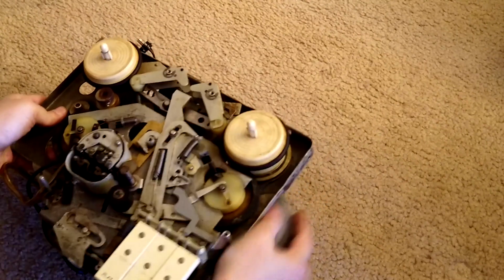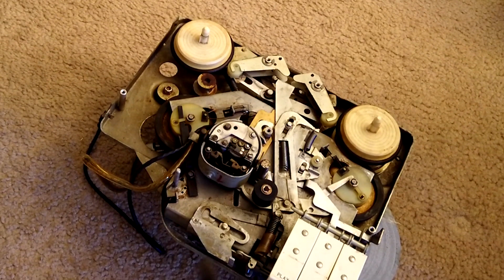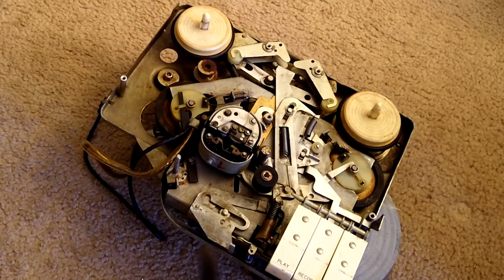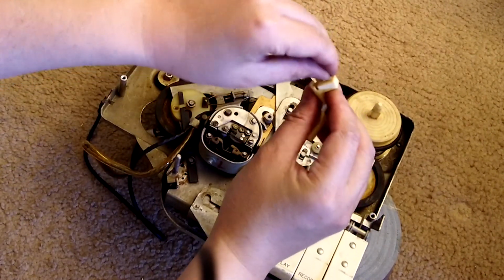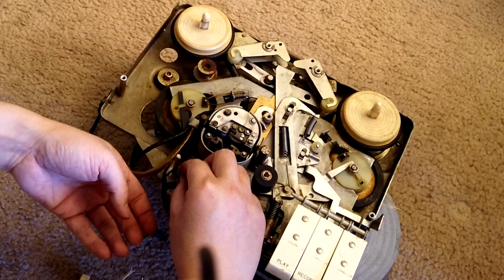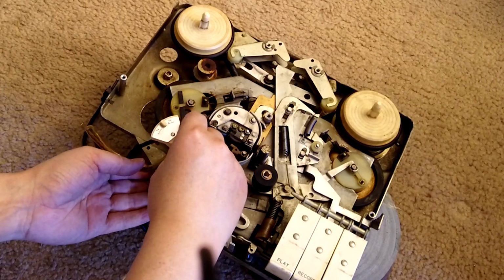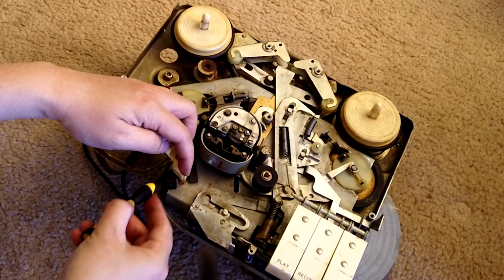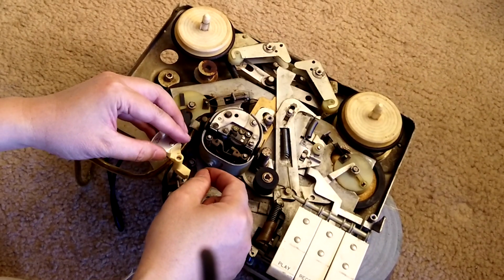Now remember the speed switch here, and that's the part we need to put back first. We need to put the upper back first, then we go to the bottom. So to do that, just remember you have the spring inserted here, right? And you put your balls right here. So then you just push this back and see this inserted to that. It just needs patience.